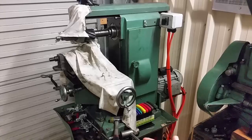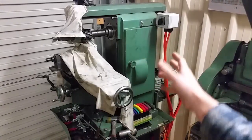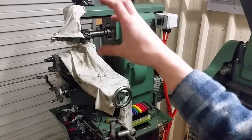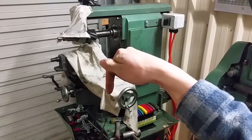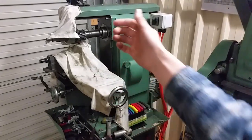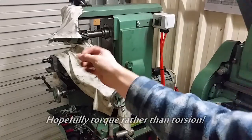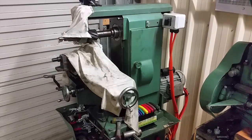The reason for this holder is for this mill — there is no quill. When I've got the vertical head in place there's no give. If I try and drive a tap with the machine it's either going to rotate in the chuck or it's going to snap. My intention is you'll be able to deliver torsion to the tap and the tap will be able to drive itself. All right, let's get into it.